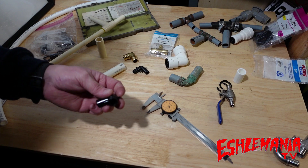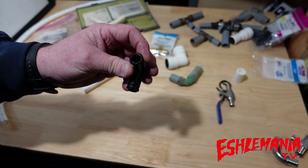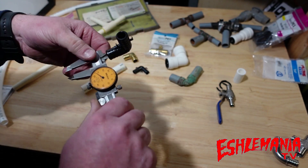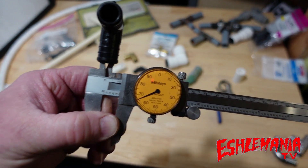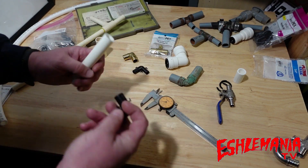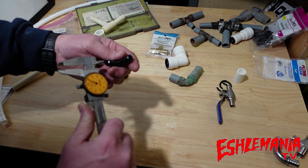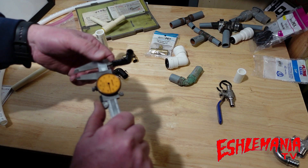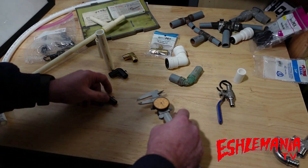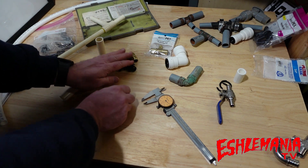So your three-quarter inch PEX tubing is now only allowing enough water flow equal to about half-inch copper tubing — that's a significant restriction. The plastic alloy connections bottleneck it even more because the material is thicker. Measuring with calipers, the plastic alloy comes in at 466 thousandths — under half an inch — for three-quarter inch tubing. For half-inch tubing, the plastic alloy fitting inside diameter drops down to 325 thousandths, well below half an inch.